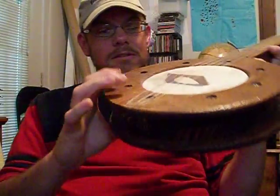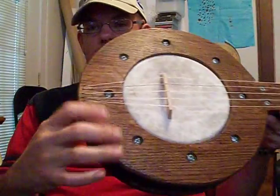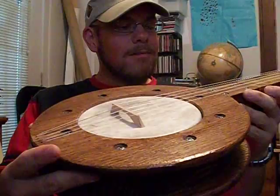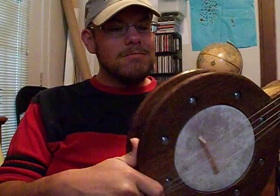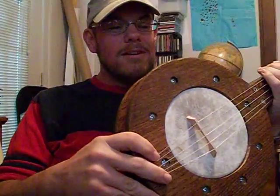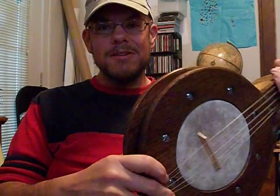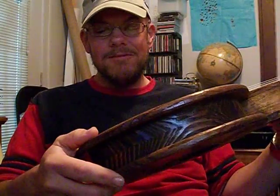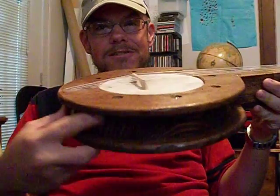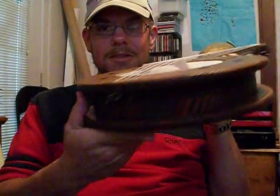The body is two pieces of half-inch red oak to make the front and the back. I'd rather not use red oak because I'm not a big fan of it, but it was the only thing I could find in a half-inch thickness. My bandsaw isn't big enough to re-saw, and I don't have a planer — I do all my thickness and surfacing with hand planes. I was just looking for something already at half inch. The center ring is some Douglas fir tongue-and-groove flooring that I had sandwiched together.